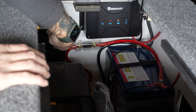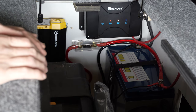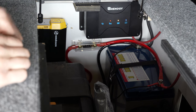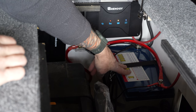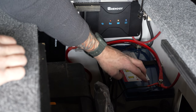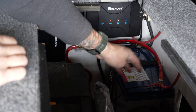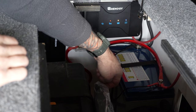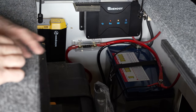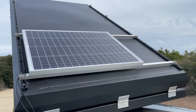Right here I have a 1,100-watt inverter. This is my charge controller — that's a 30-amp dual charge controller. This is my 100-amp lithium, and right there you can see a fuse for the inverter. This small wire and this small wire are coming from the fridge, hooked up and going right to the battery. I haven't installed the fuse panel yet — I just went straight to the battery, which works completely fine. The power here comes from the Renogy controller, which is putting power to the 100-amp lithium from the 100-watt solar panel on the roof.